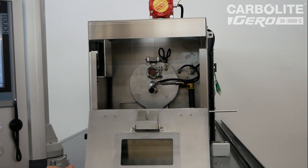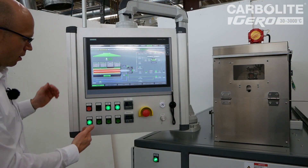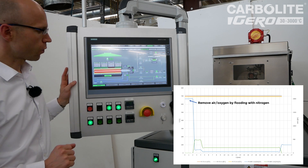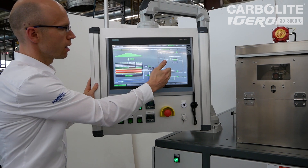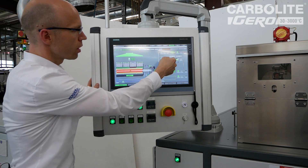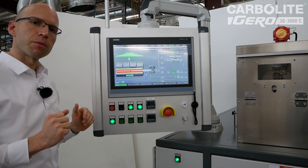To work under hydrogen, for safety reasons I close the top lid. The furnace is now under air because we had no gas flow inside yet. We start a flooding program that makes sure all the air is removed from the furnace. We do that with a nitrogen flow; this takes some time — the time is calculated so we have a minimum of 10 volume exchanges, ensuring no oxygen remains inside. Then we switch to hydrogen and nitrogen in a special mixture.